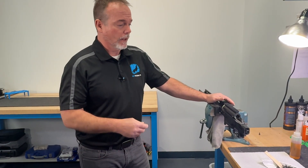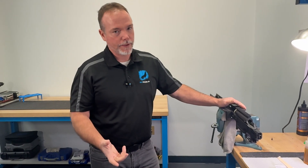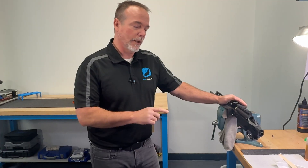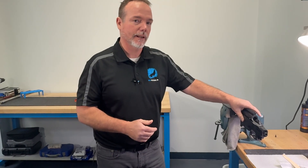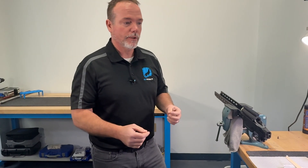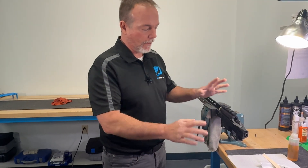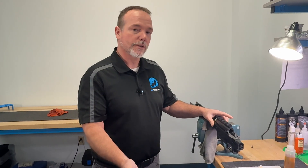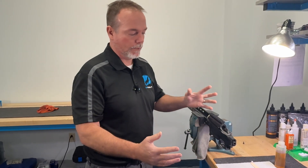We get this question all the time: is bedding absolutely necessary for a rifle to shoot great? The answer is no, not necessarily. However, taking the time to check that you're not setting the receiver into a chassis that's inletted wrong, incorrectly, or unevenly is important — that could cause an issue. When we get customer rifles and build them, we tell the customer we'll check everything to see if it really needs bedding, because we don't want them to spend money bedding a rifle if it's not 100% necessary. If it has good contact everywhere, nothing's twisting or pulling, and the inlet looks good — we'll go around with feeler gauges and give it a thumbs up.